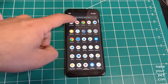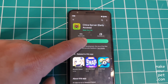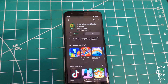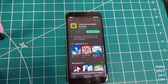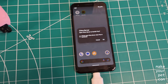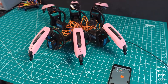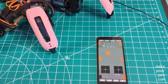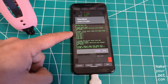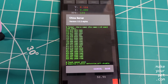The next step is to install the upgraded Chica server app from the Play Store. In the Play Store app, search for Chica server and install the app. The same app works with both Pololu and Servo 2040 ports, and I will keep supporting both ports going forward. Once the app is installed, do not open it — instead, plug in the USB cable and let the app launch itself. In the permission request popup, select the checkmark and press OK. If everything goes as planned, the robot should do the initialization animation. Also check the config on the main app to make sure it matches the 24D pin configuration. You can find a copy of the new configuration on the GitHub repo, and don't forget to update the app with your servo calibration values.